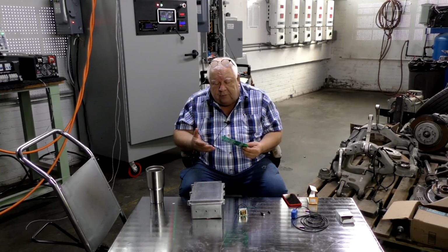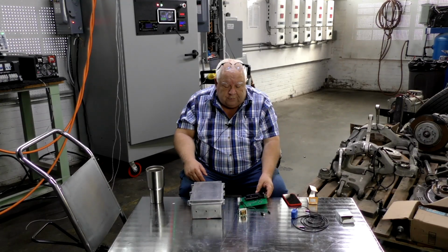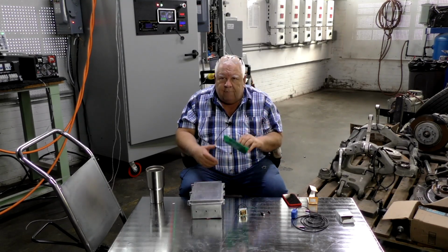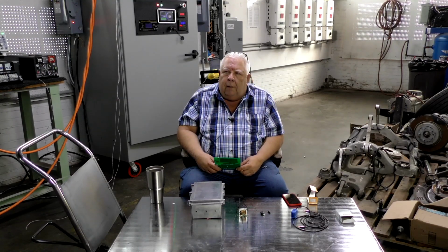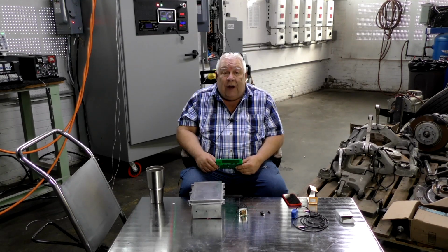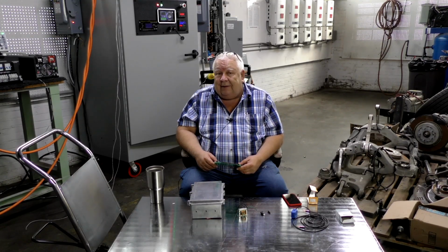The problem is we need to use this information, and we don't necessarily want it out of the building with us. But I do like wireless, and our ESP32 is working out very well. We've kind of developed, and I won't say we invented this, but we do a lot of it. I didn't really get it somewhere else, but I'm sure others have thought of it. We use user datagram protocol packets on a wireless network to carry CAN messages. Since we do so much CAN anyway, it's easier to simply replicate the CAN wirelessly by taking the same frames and putting them in user datagram protocol, UDP packets.